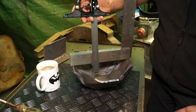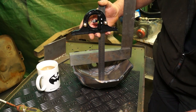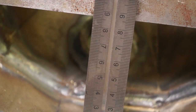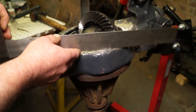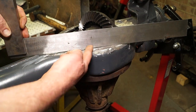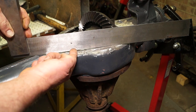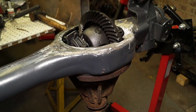The next thing we need to do is measure the depth of the pan, and this is quite easy to do using a straight edge and the ruler again. If I zoom in here, you'll see it comes out at 85 millimetres, so we've got plenty of leeway there. With a straight edge you can see what sort of gaps you have and how the grinding has been uneven — you'll never get anything completely accurate with grinding, but you have to try your best to get it as flat as possible.